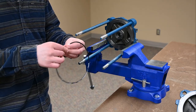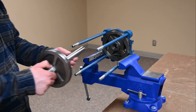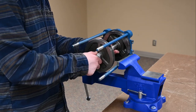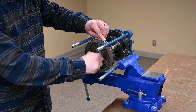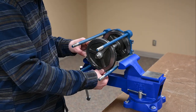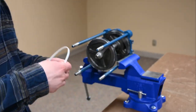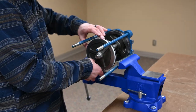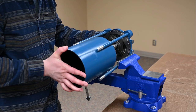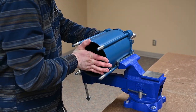To assemble the cylinder, lubricate the groove in the cylinder head, then lubricate and install the O-ring, wear ring, and piston seal onto the piston. Install the cylinder tube by sliding it over the piston — the piston seal must be well lubricated. If you have trouble installing the cylinder tube, you can try starting it at a 45-degree angle; in order to do this, you will have to remove at least one of the tie rods.